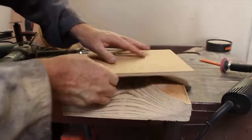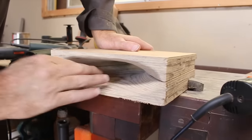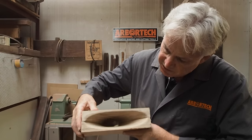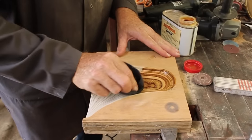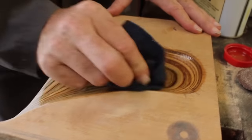One other little trick: it's very difficult to get the two halves exactly matching top and bottom. So what I do is round the edges so that there's not a defined edge as they come together. Here's the top and there's the bottom — they come together like so and you can see down inside there. I'll actually oil the inside first, wipe that, and then glue it together. Then I'll just round the edges and finish it off and that's it.